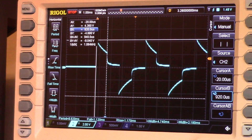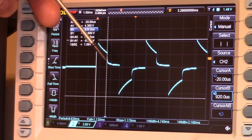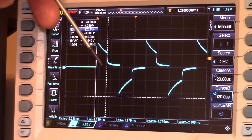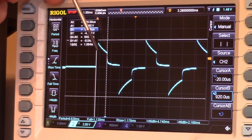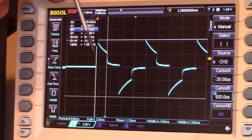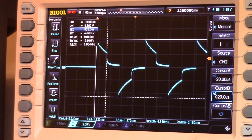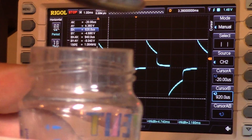I suspect that as the EC increases, as you get more and more conductive solutions, the angle of this slope will go further and further, and therefore the amount of time it takes for this voltage to drop from the starting 4.5 volts down to this 2 volt cutoff level will decrease. So the more conductive the solution, the less time it takes for this voltage to drop off to this cutoff value. Let's see if we can prove that — I'll go and get some salt.